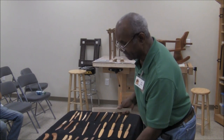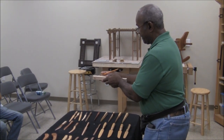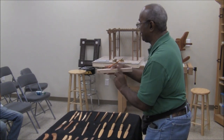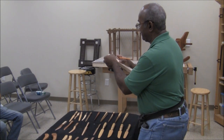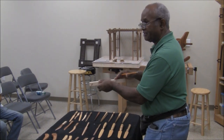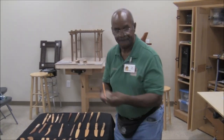And the thing I'm doing here is, I say, if I was on the table saw, my fence is here. I can pull my fence out to where I know exactly where the blade is going to cut. So I can cut half of this off. All right? And I'm pushing this with my push stick through the saw, so my fingers are still not anywhere near the blade.